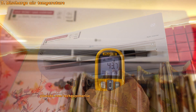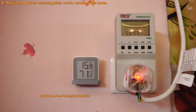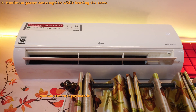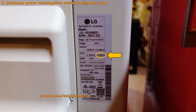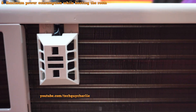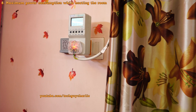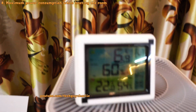This thing blows proper hot air. The temperature of the air coming out of the vent is at about 44 degrees Celsius — this is at 650 watts. The maximum power consumption I recorded in heat mode was 1.5 kilowatts, when the room was at about 15 degrees Celsius and it was quickly trying to heat the room up. This air conditioner slash heat pump is actually rated to pull about 2.1 kilowatts in heat mode, but that will happen when the outside temperature is even lower than 6 degrees. These inverter units have temperature sensors on the outdoor unit and adjust the power needed depending on the temperature outside. So 6 degrees Celsius is just not cold enough for it to run at maximum power in heat mode — these things are designed to heat even when it's sub-zero outside.